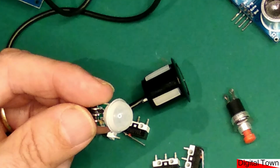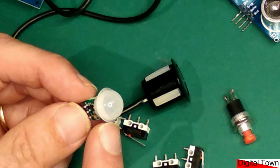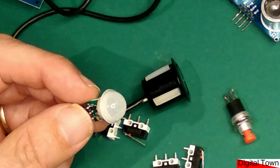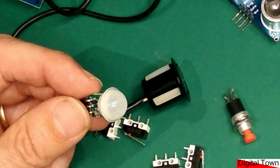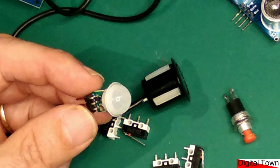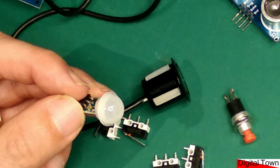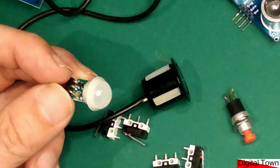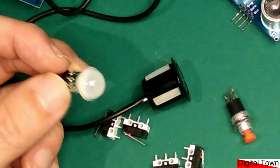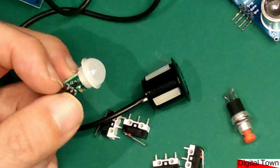So it meant not only did I have to have the movement sensor in the project, but I also required a temperature sensor to make sure that, if you like, the environment that the unit was running in was safe for all the components to work in. And again, that's one of those little things about fail safe. Is the sensor that I'm using the right one? You know, I like photo interrupters, but completely useless in a dusty environment. For something like that, you'd want something like a magnetic hall sensor.